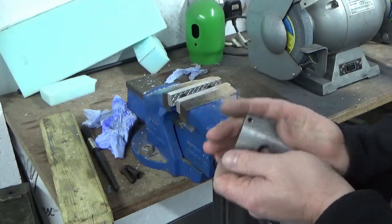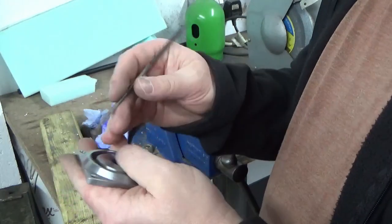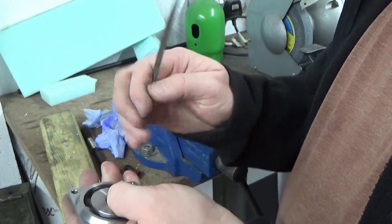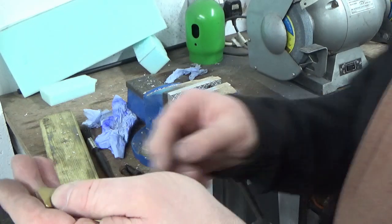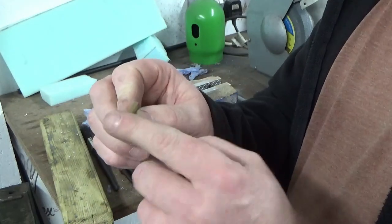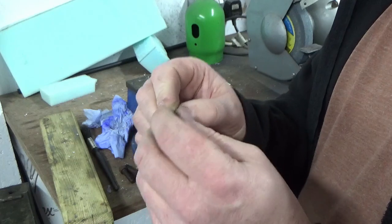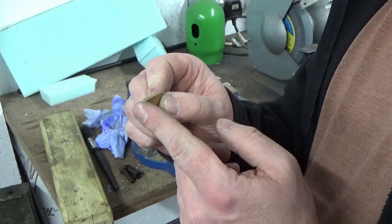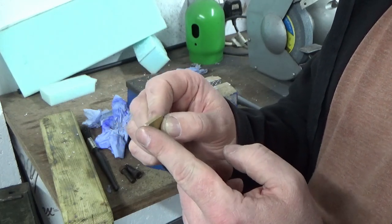And that's important in the context of this, because I'm just going to poke that back out now from the inside. This is calling for a light press fit. Now, trying to do that all the way around the periphery of something and judge the light press fit is quite difficult. It's often a lot easier to make it a really tight sliding fit and then upset the surfaces, which is what we're going to do to make the light press fit.